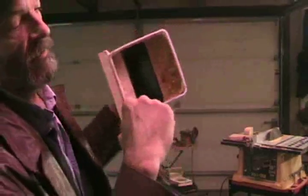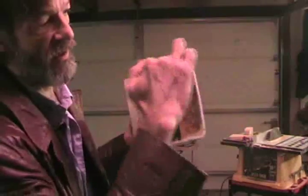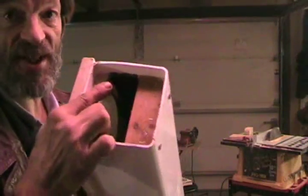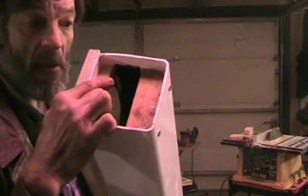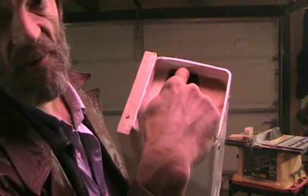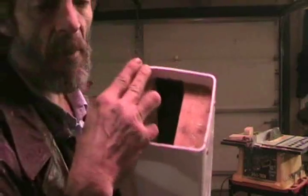Once inside the box, however, I did carpet. Now the reason I used carpet was I didn't want the plastic to resonate too much. A little hard to show, but on 3 surfaces, this surface, the back surface, and this surface, I put in black carpet. This is a carpet runner. It's a sound deadener. I was trying to keep standing waves from getting in here and echoing too much and changing my frequencies. So I glued this stuff in with that spray adhesive. I got the carpet runner cheap over at Home Depot. Worked real well. You just cut it with a razor knife or scissors.